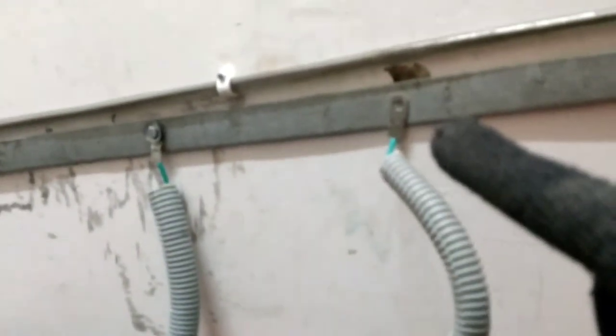From here the wire is going inside the earthing pit. This is a separate earthing I have done for the DC DB. The DC DB and AC DB are separately earthed. Here is the bus bar which is coming for the earthing. I have connected the inverter and the DC DB to the earthing bus bar.